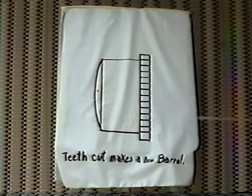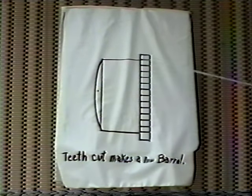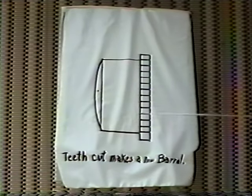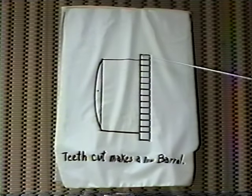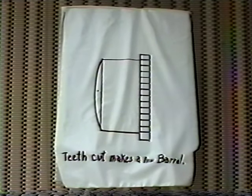we take one cutting first, and then we take a reading on it and see if we have the same or close to the reading of the original barrel. If it isn't, then we set the depth a little bit deeper and cut it exactly to the same OD diameter as you had in the original barrel.